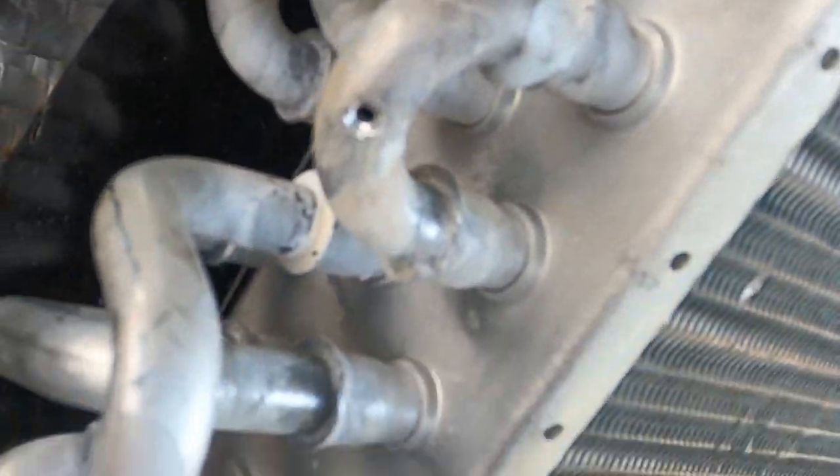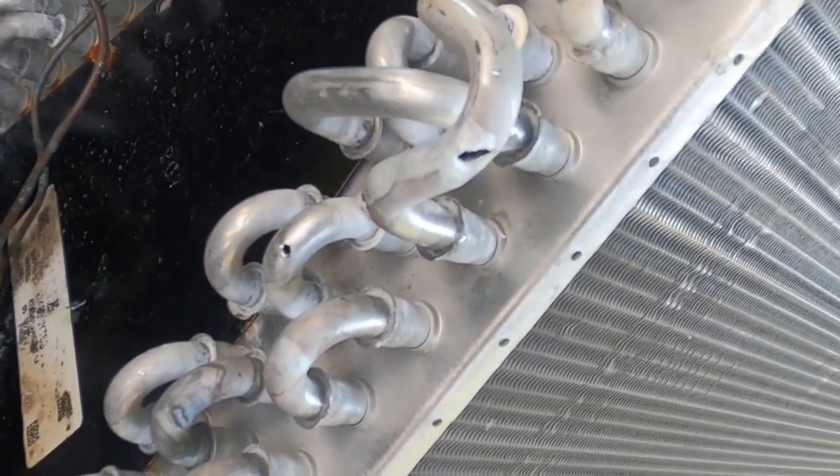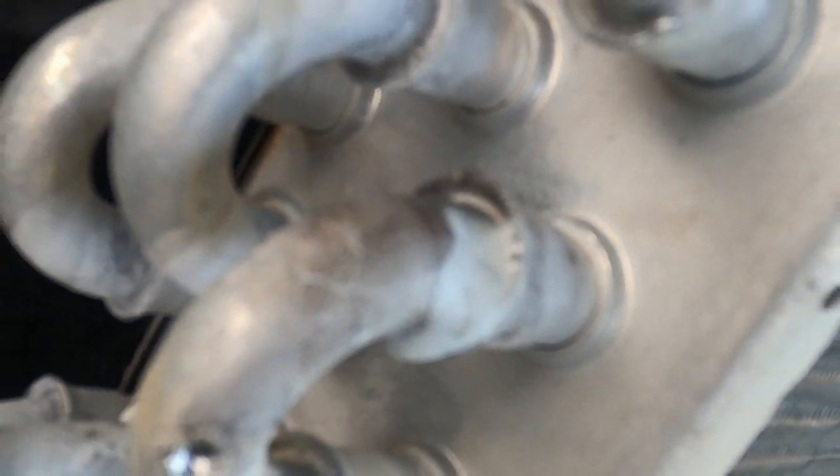So it's an opportunity if it's accessible. Getting down in somewhere trying to fix a leak, you might melt the drain pan and cause some damage. You have to assess your situation and see what's going to work. But if you've got a U-bend out here somewhere leaking on one of these coils, and it's going to be $3,000 for somebody to replace a coil as opposed to maybe half that doing a quick leak repair — maybe squeezing two or three more years out of the system — then AL822, guys. That's what I use and that's what I'm going to keep using.